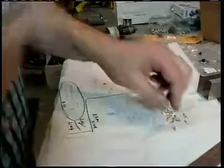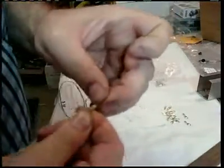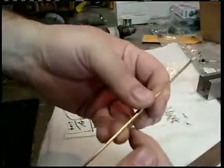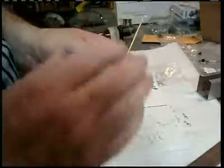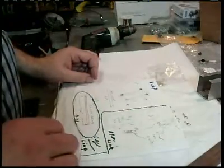What you're going to try to achieve is, on one end you're going to need the eyelet, because it's going to connect to the motor gearbox to move things, and the other end we need to cut at the correct length so that the robots will work right. Both the walking rods have to be exactly the same, otherwise your robot's going to walk to the left or to the right or have a little bit of a limping problem.